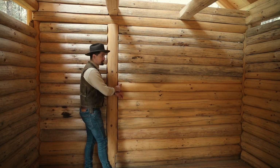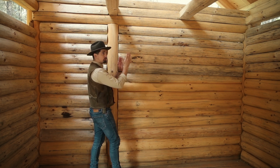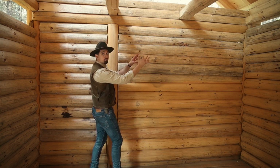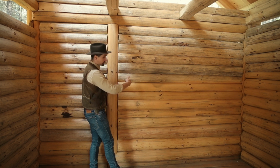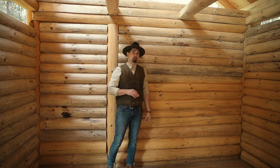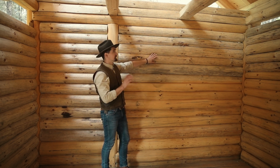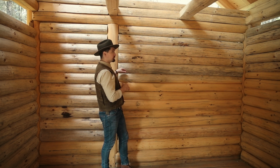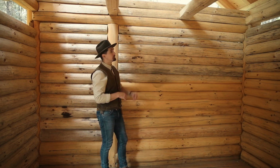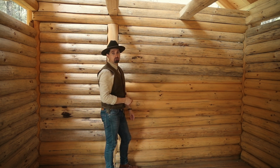That is because when I was building up the walls, I wanted to create some structural support. These posts were open-ended, so if I put too much force on the walls, the posts were going to start to splay this way. So I did have them braced, but as I went up, I also screwed a few screws into the post, knowing very well that once these are all dried and settled, I'm going to be pulling this all out for two reasons. One, I still need to sand them really good and give them a stain. I also may want to run some electrical in between them anyways. Because they just slip in, it's really no big deal to pull them out and do what I need to do. Now that the frame is all built around it, these walls can just pop out real easy.